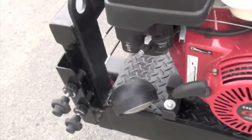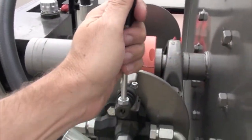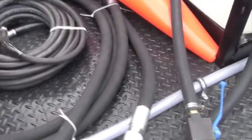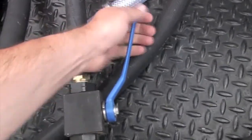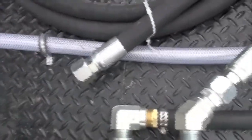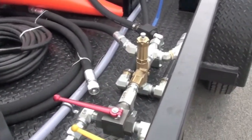Make sure you follow all your safety precautions — good boots, good gloves, eye protection. Back here is the hydraulic unit — it's good to get that started and warmed up. Start your engines and let those warm up for a minute or two, let all that kind of warm up, get the fluids flowing. Your control for your hose reel valves is right here. Once you're started and warmed up, place the nozzle in the pipe you're cleaning. Then shut off your supply line, which is right here — your bypass line, your easy startup valve. Close that line and you'll hear the unloader kick in, and then you're ready to jet.